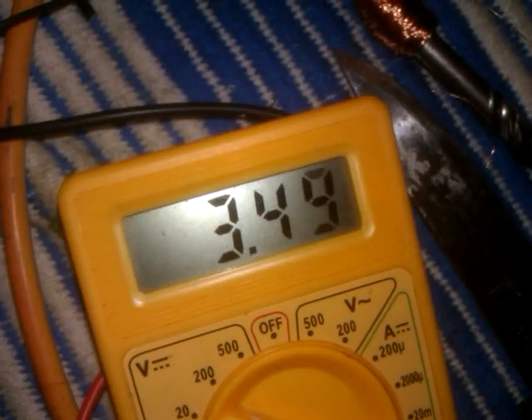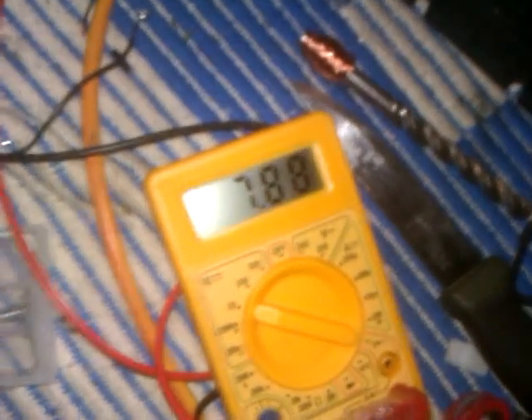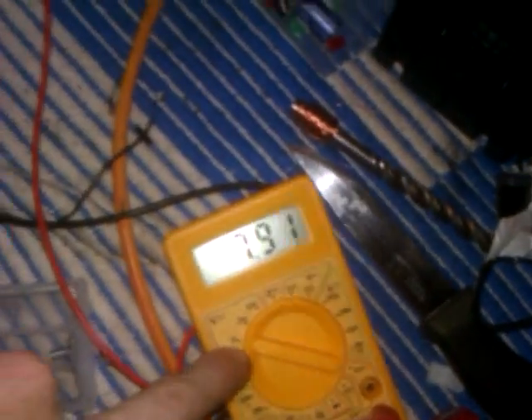The light you can see is currently coming from a tap that's running, and it's not running particularly fast. I'm getting three volts — but if I turn that light off, that other light goes a little bit brighter, up to four volts. If I switch this light off as well, it goes back up to seven DC volts, because the rectifier is rectifying.